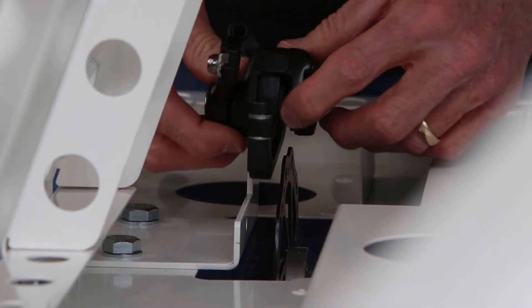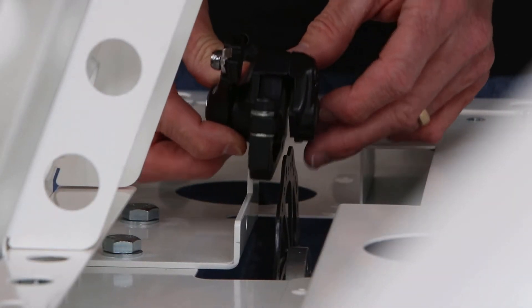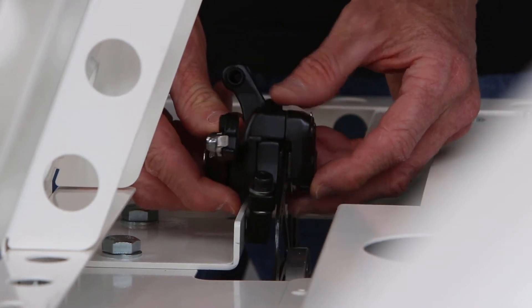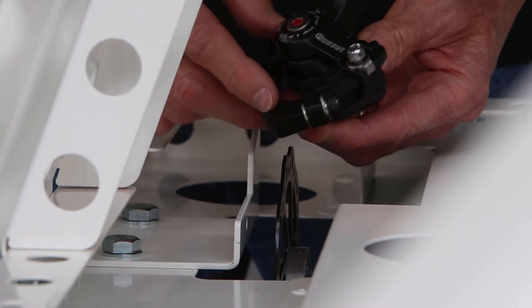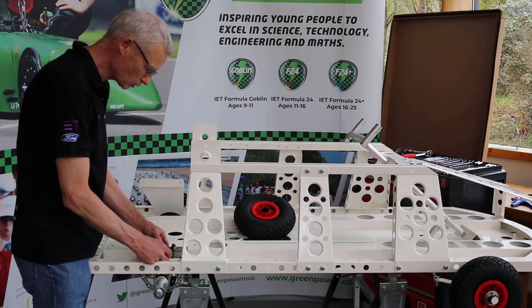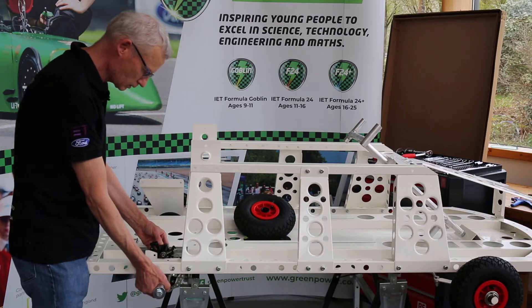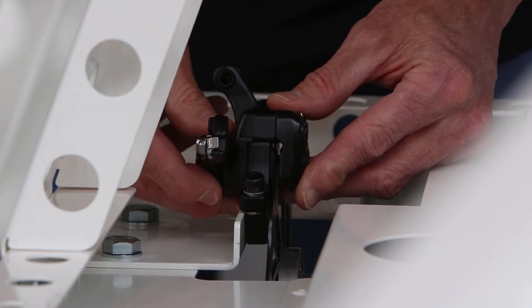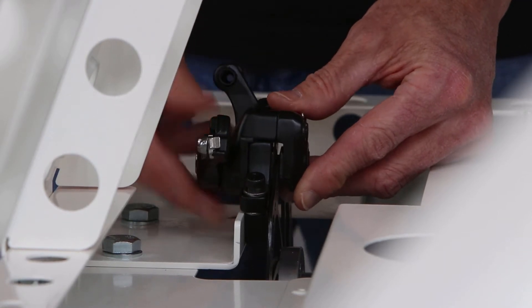It sits with the slot with the brake pads sitting over the brake disc. To get an approximation as to its position, what we've got to do is actually move the whole axle across the car. So I can pull that across and now my disc is roughly in the centre of that gap for the pads.